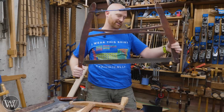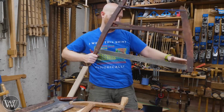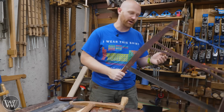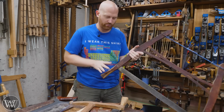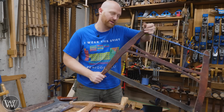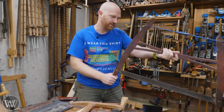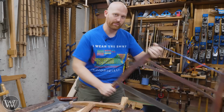With the buck saw, it's a little bit different. The handle is down here below, and so you're doing much the same except for you don't have that horn to run off of. The buck saw usually is a two-handed saw. You have one hand up here and one hand that comes up here or even up onto the horn. When I'm starting it, I'm often holding it on top here, and I'll get into it, and then once I get going, I'm putting my weight into it.